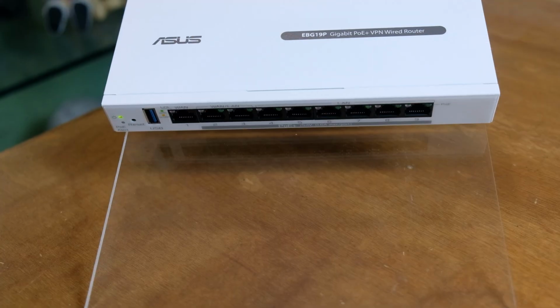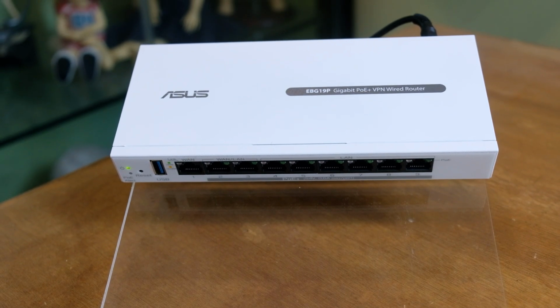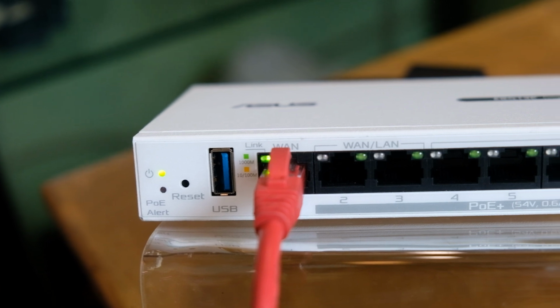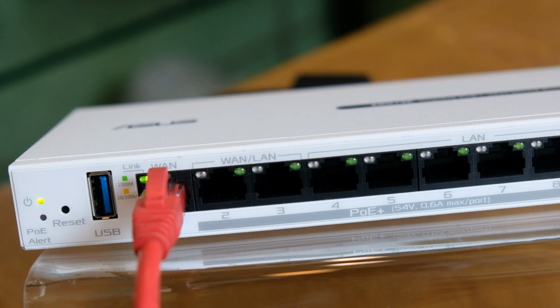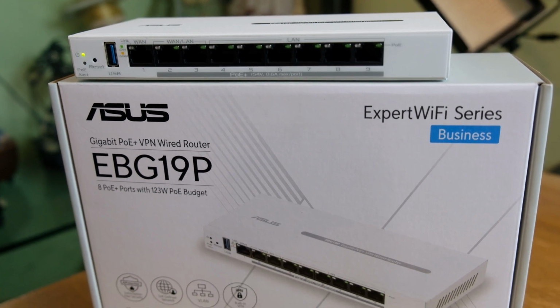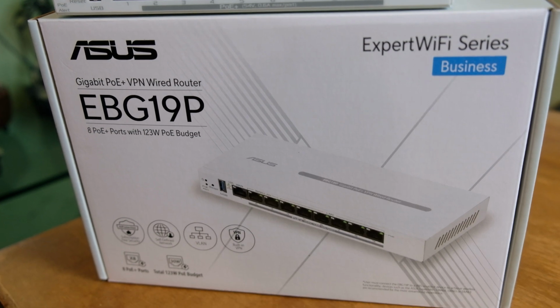And for the specification, it runs on a 1.8 GHz dual-core ARM Cortex-A53 processor with 512 MB of RAM, with 8 PoE+ ports capable of delivering up to 123 watts of power for various PoE-enabled devices. While 3 Ethernet ports can be used with load balancing, and in addition, the USB port can be used as a backup for mobile internet or a mobile phone. For the other features, we will run through them later on by accessing the web management console, and I'll include the link in the description below for the full specification.